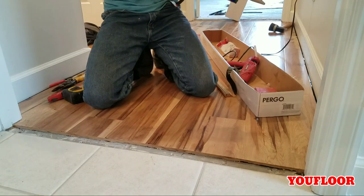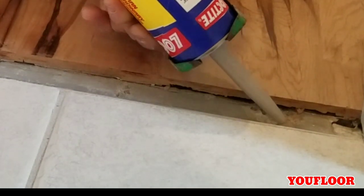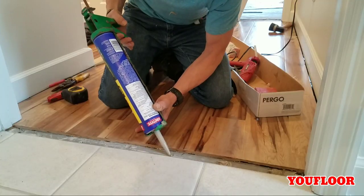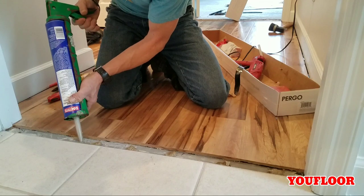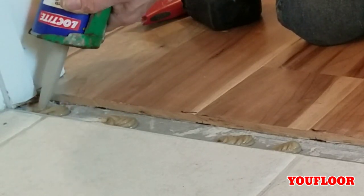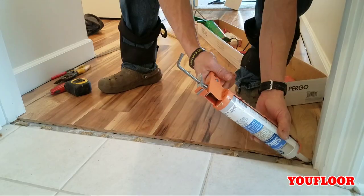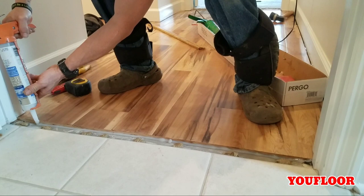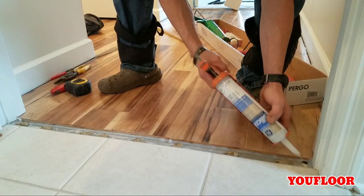I want to make this very clear — once this stuff cures, it will become one with the tile and the concrete and it will not move. So make sure your gap is big enough to allow for the glue and the quarter-inch expansion gap. I usually leave about an inch and a quarter with the four-in-ones and put the glue up as close to the tile as possible in big tall clumps. Years ago when I first started using this stuff, I got a little too close to the laminate. When the seasons changed, the laminate did what laminate does — it wanted to move, but the transition said no. The floor had nowhere to go but up. I had to remove the transition without damaging the floor. It came out in pieces. Then I had to trim the laminate back with an oscillating tool and re-glue a new transition. I learned a great lesson that day.